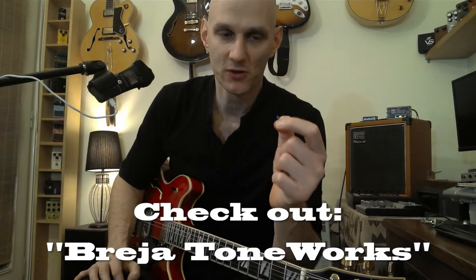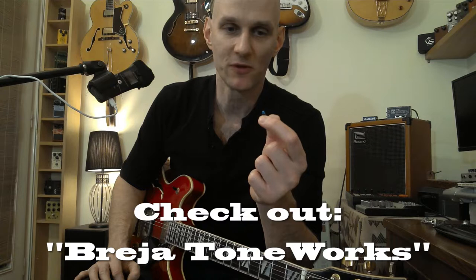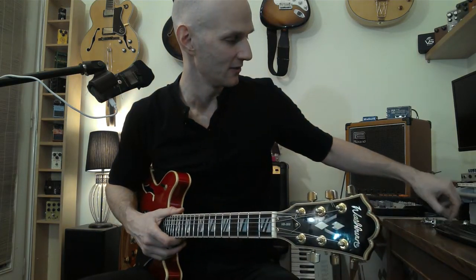Don from BREJA TONEWORKS explains that there's actually, he mentions 3 types of treble bleeds. This is the simple one, but there's also the Duncan one and the Kinman one. Each of them have different values and they affect the amount of treble differently, well, the amount of treble that either stays or gets shaved off when turning down the volume pot. So I'll put a link to that in the description below. I highly recommend you boys and girls checking that out.